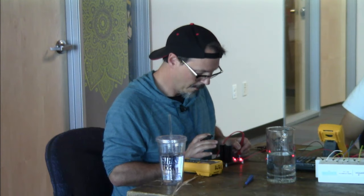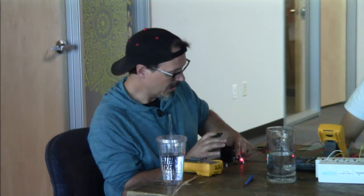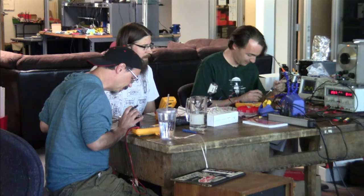So now, I'm just going to throw the standby switch and see. I think it'll come up to about 90 milliamps with no input. 100, 110. So we're good. Nothing wiggy is happening at the speaker. Yeah, I think we're good. I'm ready for a signal.